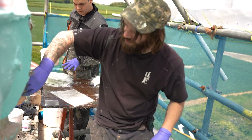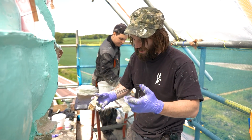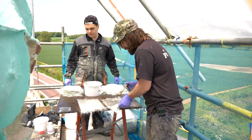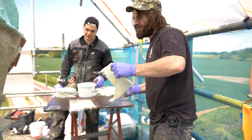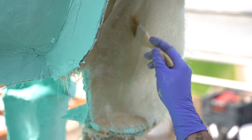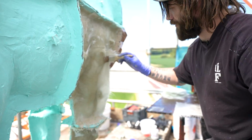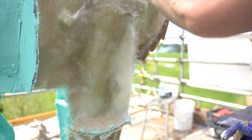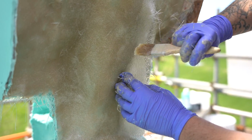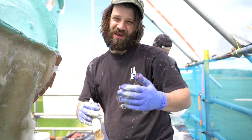So gang, the beautiful thing about resin work is that it's actually quite a quick process if you've got the technique down. So what I try and do is I always use one hand that's meant to be my dirtiest hand and then one hand that's meant to be my cleanest hand, but in this case they're both dirty. But the theory is, you grab your resin fiberglass with one hand and then you use your brush as the tool. What I tend to do is I just sort of eye it up and I push the brush down on top and I start from one end and I stipple it down until it's stuck. Then I work my way to the middle until finally it gets to the other end. And then once you're stippling it down, it tends to want to just stick to the actual resin that you've got down there already. And because we're on a vertical, I've had to sort of lean and get in all different funny angles, but now it's all on, it's stuck to itself, and now we're just going to stipple it on and push all the air to one side, and that's how you end up putting one laminated panel of resin fiberglass on without getting yourself in a bit of a tizzwaz.